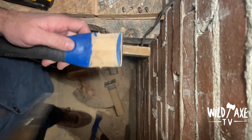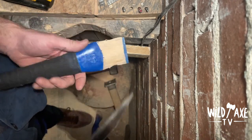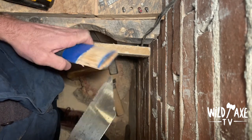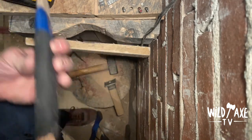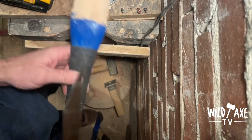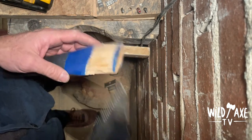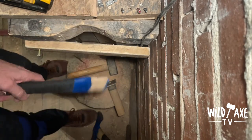This is a lane axe. The handle broke — the kerf wasn't that deep, it really could have been in there deeper. Just dissecting this as a forensic analysis: I know how it broke. Somebody threw it hard and it snapped the handle — that can happen, happens here a lot. I think that wedge could have been in there deeper, although the head didn't move because we broke it before it had a chance to. But that one's toast.